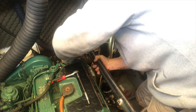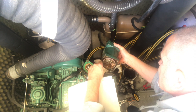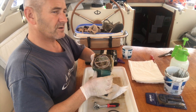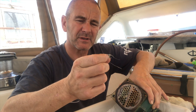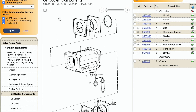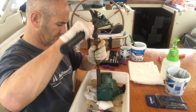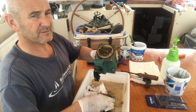Before removing the oil cooler I also had to remove the pipes leading to and from the anti-siphon bend. So I've got the oil cooler off now and it's not too bad, but there are some tubes blocked — calcium deposits and even bits of rubber. Looks like a bit of an impeller blade there. I'm going to take off both sides and give it a poke through, clean it up and put it back together. This probably hasn't been off for over 20 years.